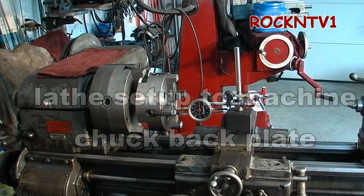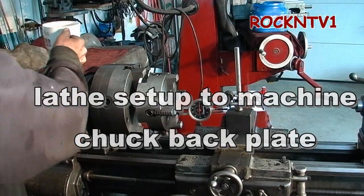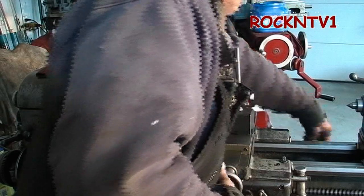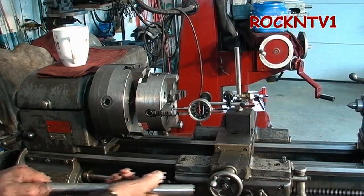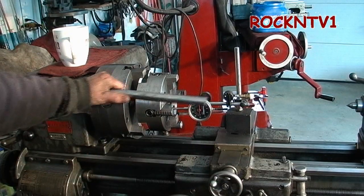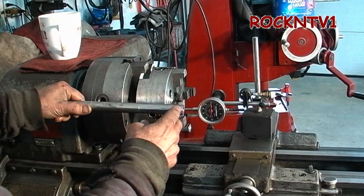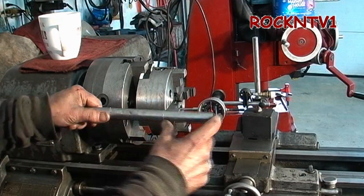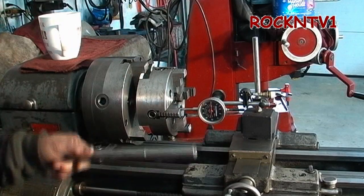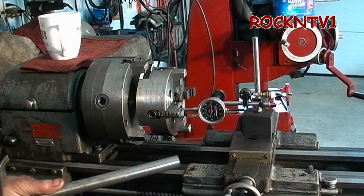So where is this leading me to? All of this work on this spindle. I can tell you that I just carved this piece here, and it's better than the four inches I just carved. I stuck it out about five inches, and it's within tenths from here to here — almost dead balls within tenths. Not even tenths. A tenth. So a tenth over four inches on a 170-year-old machine. Good.